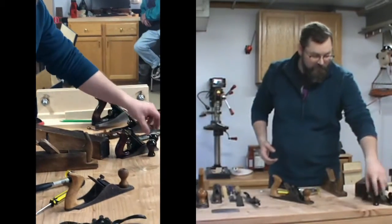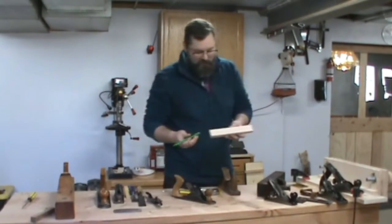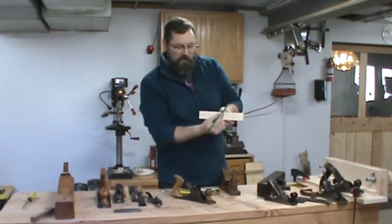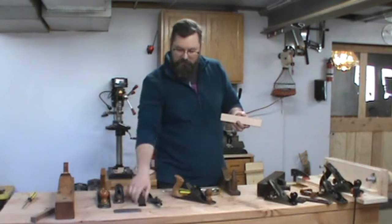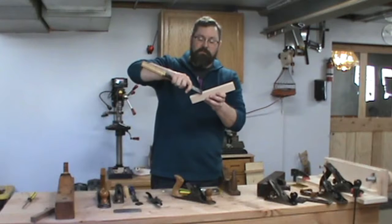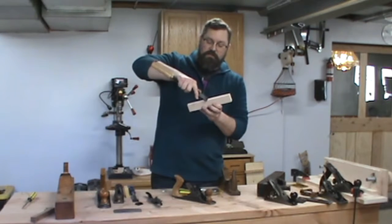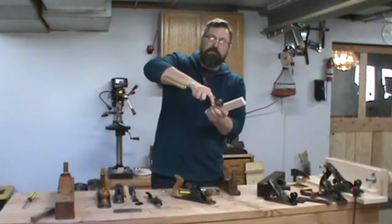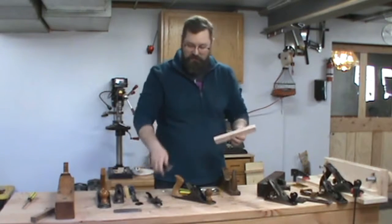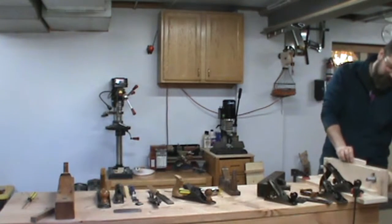If you try to use a plane with a very narrow opening and a flat iron, it's going to take forever — you're going to have to stop and sharpen it several times. I picked this piece of maple because you can see the grain lines are going in this direction — they're going up the board. If I come along and cut this way, it's going to compress those fibers, whereas if I go in this direction with the grain coming up, the chisel is going to wedge into the board and lever that wood up and break it — that's what's called tear out.